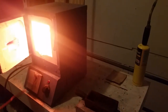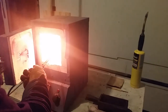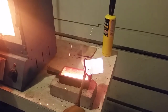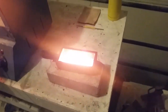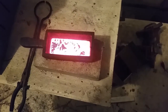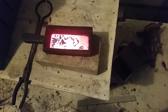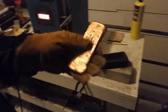That fire you see is the crucible burning — that's the carbon reacting with oxygen to produce CO2. The concrete patch seems to be holding up just fine. We're going to let this sit and harden for a minute and then immediately dunk it in water. You can see all the black spots — that's the flux and stuff that will hopefully crack off when we throw it in the water.